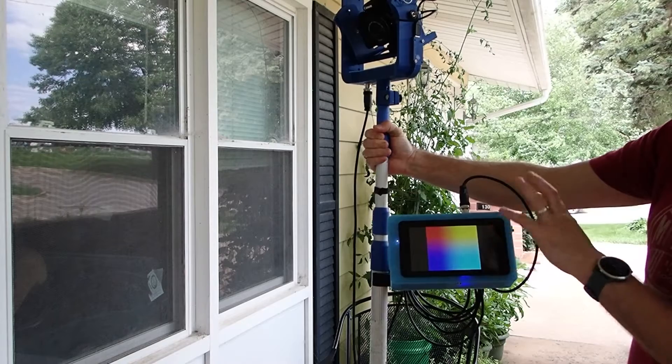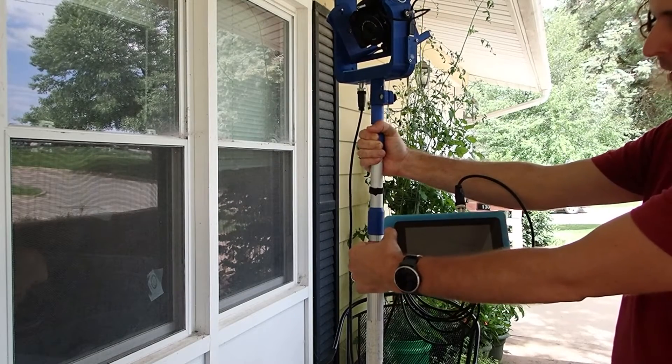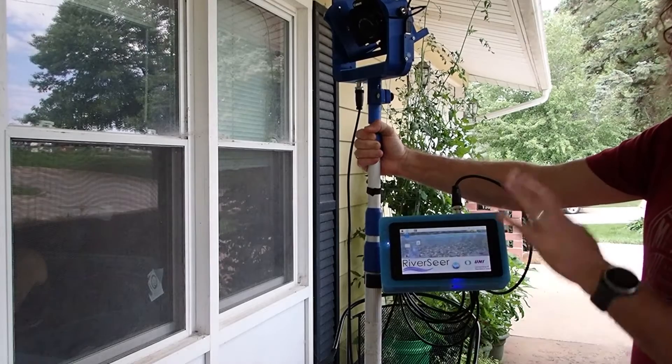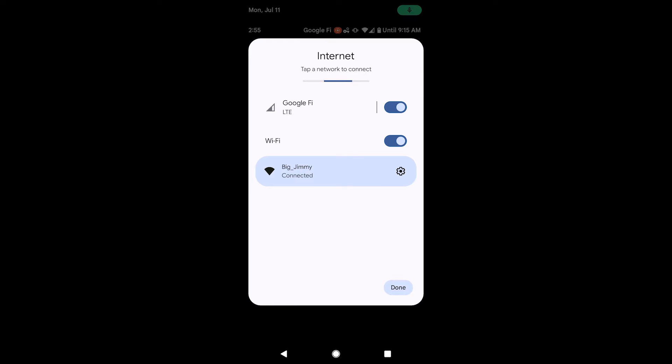On the screen you should see a colorful splash screen and then some boot-up information. On the left-hand side is the battery indicator — if fully charged you should see four lit dots. Once you get to the main screen, launch the main software. To set up the GPS for post-process kinematic collection, you need to connect to its Wi-Fi hotspot. On your device, go into internet settings, go to Wi-Fi, and look for the hotspot for the specific GPS unit — in this case it's Reach RS2, and the one I'm using is f5d7.